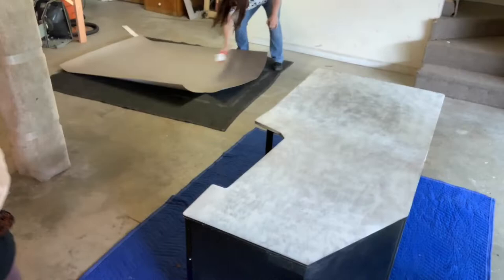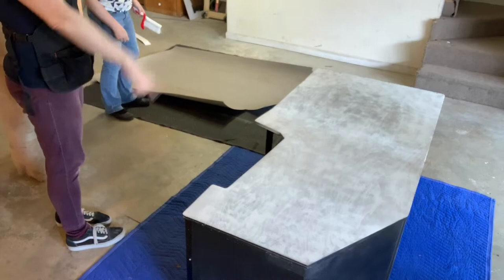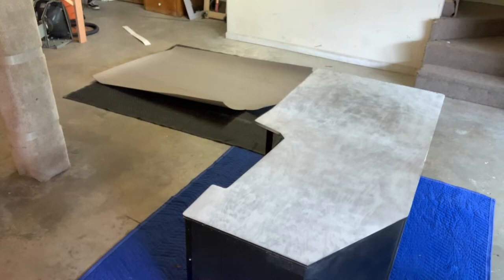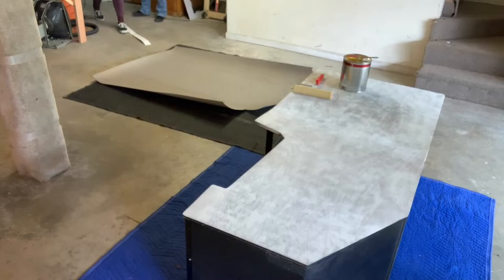We're ready to put the laminate down. My wife is brushing off any debris from the back of the laminate and the cabinet. I like to use these big industrial moving blankets — they're great to have around when working on arcade games so things don't get dirty and the laminate won't get scratched. Again, you want a really well-ventilated area because you're dealing with some pretty toxic glue. We have our glue, our roller, and our gloves, which you definitely want to wear.